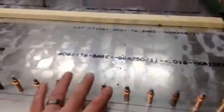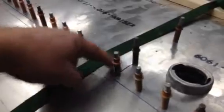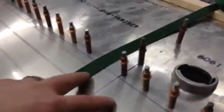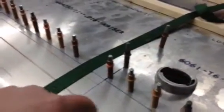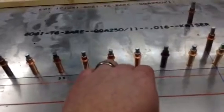Now my skin isn't pre-drilled, so I had to pull it into place. I went ahead and drilled all the spar ones now. Went ahead and laid out my marks. If you'll see, I drew a transfer mark here. This transfer mark was put on there in reference to the center of the rib underneath the skin before I put the skin on. So then I could go along after I got the skin on and take those marks and transfer them onto the skin and draw my rib lines out nice and straight. I used the skin here as a straight edge and drew those marks all the way out.